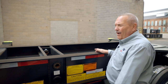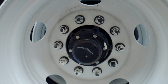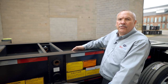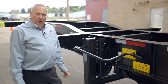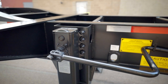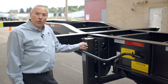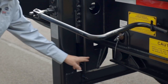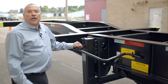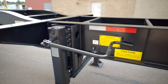On Cheetah's 2040 Maximizer you'll note that there are four steel wheels which facilitate the bogey when sliding. Each bearing has a grease fitting so that during your normal maintenance schedule you can apply grease to keep them rolling and prevent flat spots. Our Bridgemaster chassis uses a Jost landing gear, though there are options for any other type, and we use a universal mount so that any landing gear leg will fit. We also use skirted landing gear, which helps protect the upper leg from damage when going over speed bumps, and we use a four-inch by five-pound-per-foot channel bracket on the bottom to facilitate any damage.